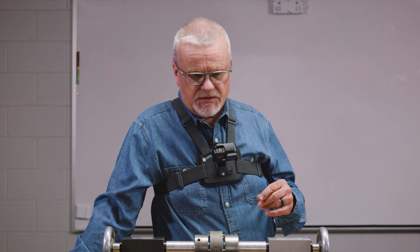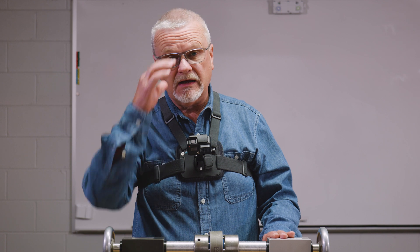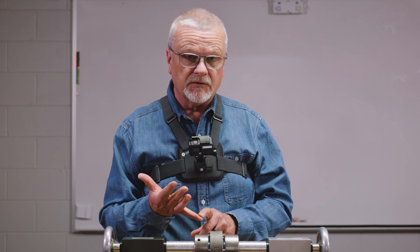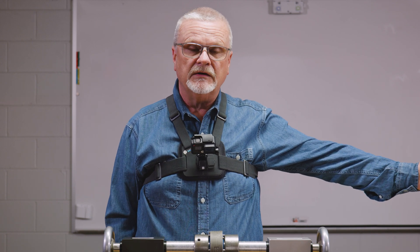This little contest we're going to do — just to be honest and straightforward with everybody — I roughed in alignment on both of these machines, and they are, as far as I could tell with a straight edge, the same. I roughed them in vertically and horizontally, minimized the soft foot, and tightened the bolts down in a controlled, repeatable pattern — the same thing we always do in our alignment training classes. So these two alignment demonstrators should be just about exact clones of each other. The only variable is going to be whether the old grizzled guy with the dial indicators can do this as quickly as the young man using the AT100.